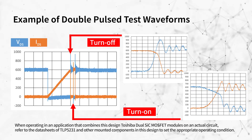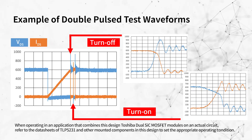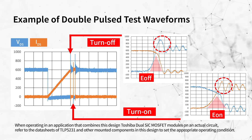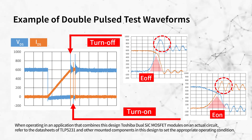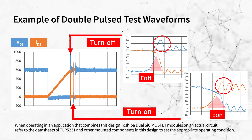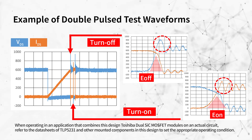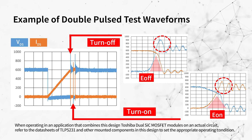Focus on the first falling (turn off) and the second rising (turn on). The gate drive circuit of this design provides appropriate VGP and VGN, and suppresses the drain-to-source voltage surge, the drain current surge, and the drain current ringing. Be careful not to get an electric shock or burn when checking the operation.